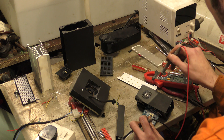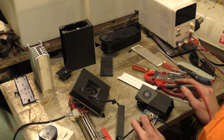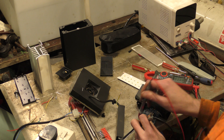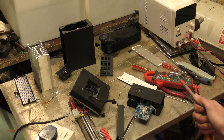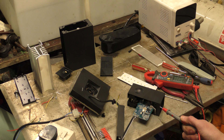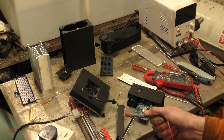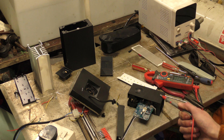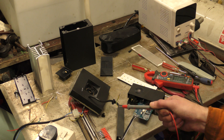24 volts divided by 10 would be 2.4 volts per LED — would that be right? Do you think the 24 volt line is purely there to run the LEDs? The camera was still working when I took it down — the camera module still worked. And when I turn the power on I can hear it click, which is usually it switching between infrared and visible light mode. So it looks like, had I not ripped off the wire to that bit, I could have replaced the power supply with another 5 and 24 volt supply and had it still work, perhaps. Because the LEDs do light up — it appears that the 24 volt rail on my power supply has failed.